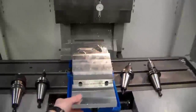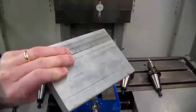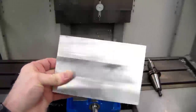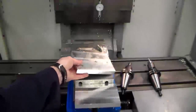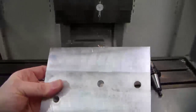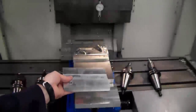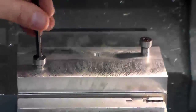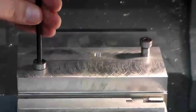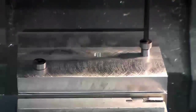Let's take a look at the two setups to machine this part. For the first setup, the material blank has already been face milled on the bottom surface. The first setup will face to thickness, spot drill, drill and ream the three holes. The part will be held in a machine vise for this set of machining operations. The second setup will transfer the part machined in part one and locate and fasten the part to a fixture to complete the remaining operations.